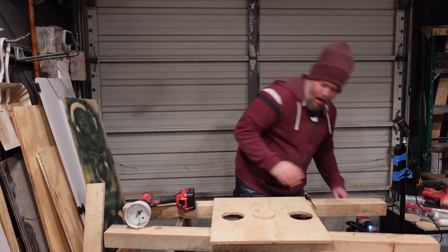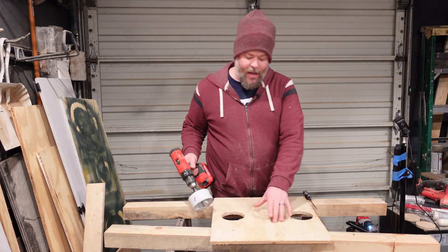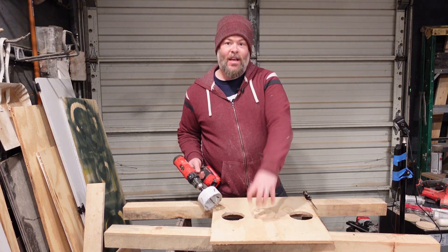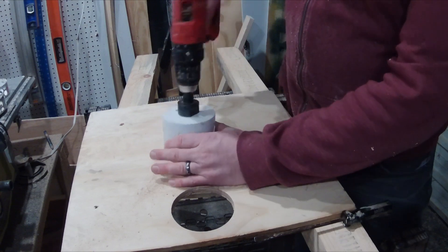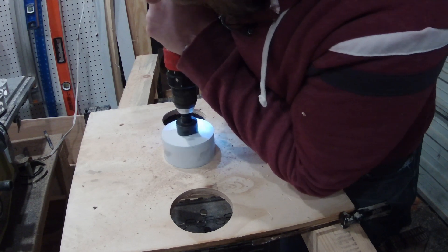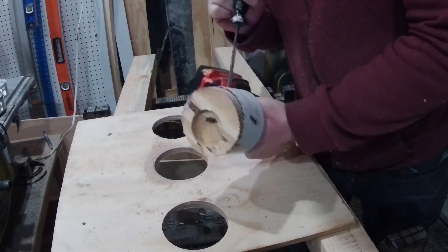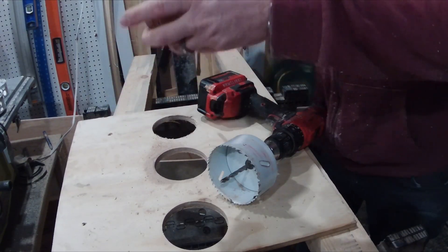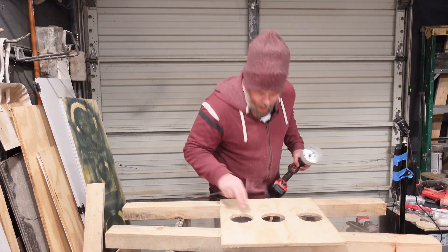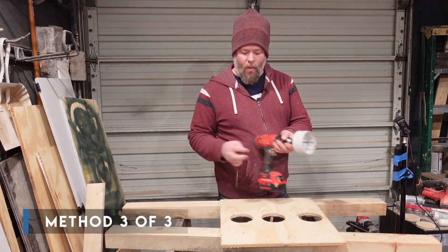Now you might be thinking — but all you're doing is putting brads in it again. Yes. But when you're done, after you pop this in and cut this piece out, the spots where the brad holes are is just in the piece that you're pulling out. So you're not actually doing any damage to any finished part, and you can use your guide there. When I pop this piece out, you can see the brad nails are still left in this piece, which you were going to throw away anyway. So now you have a nice clean hole with no brad nails stuck in there.